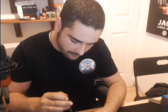I mean, people say a 0.2 build is not low enough on a single 18650 mech, but I think it depends what you build. These are small microcoils and they chuck. I usually build 0.2 on a tube mech for the first time, just until I know what it's capable of, and obviously batteries and all that are really important. With the HP6s, you can build a bit lower. I wouldn't recommend it unless you're confident and you know what you're doing. I've gone as low as 0.05 before in my legendary competition mech, and it was pretty good. But you've got to know what you're doing with these things. You've got to understand your battery safety and your Ohm's law. So make sure you know what you're doing before you start chucking mega low builds on your mechs.